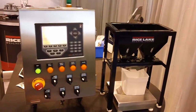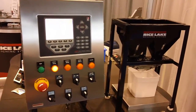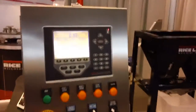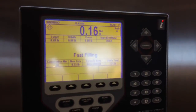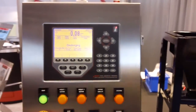We can set up for an auto discharge. When we start our batch, it fills our first ingredient — switching names for each ingredient. It lets you know what our target weight is for each fill. It hits that target, and we now automatically discharge, with the indicating light confirming discharge.